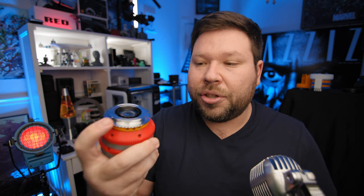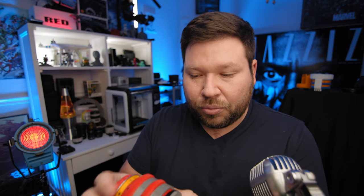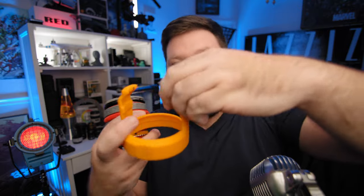The three things you have to buy: you need the M42 to EF mount — it's good that you don't 3D print this because being metal means it'll be nice and sturdy. You also need two different sets of screws; one set you don't need if you skip one piece, but you do need the grub screws, which are the most important. You'll also need step-up rings. I went from 43mm to 62mm, which brings you right above the 3D plastic, and then another step-up ring from 62mm to 72mm — all my filters are 72mm, so it works out perfectly.